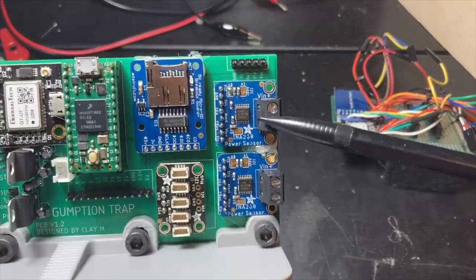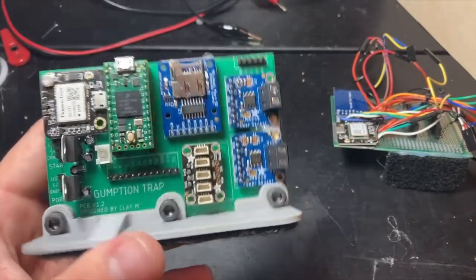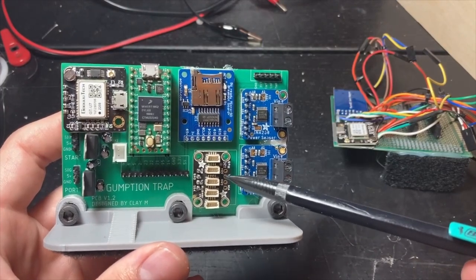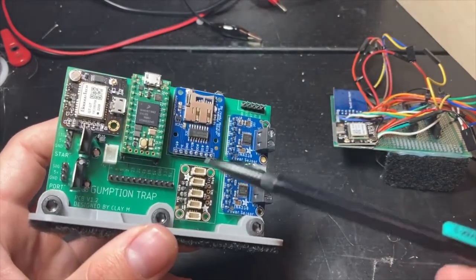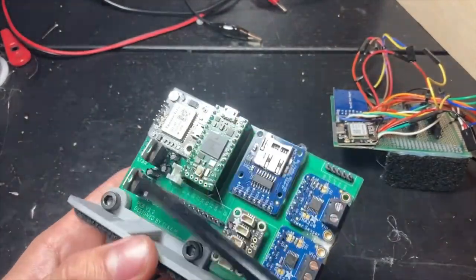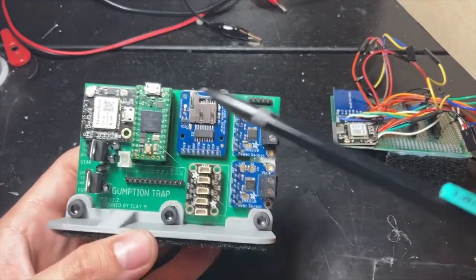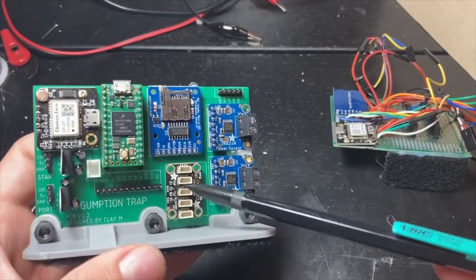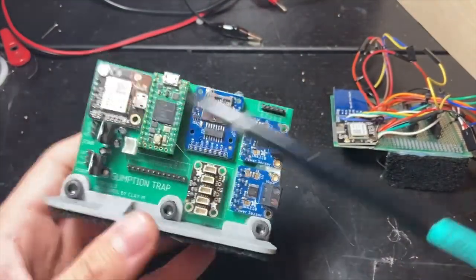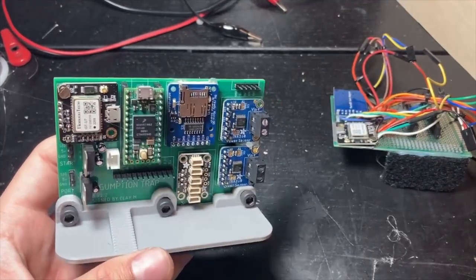I've added these two power sensors, one's for the power output and one's the power in from the solar panel. That'll detect the voltage and the current throughput. There's an I squared C expansion module, so I'll hook up my compass to that and possibly some other future additions. There are also 3V3 voltage regulators and some small capacitors to go with them. Those power the GPS, the power sensors, and the I squared C, as well as potentially some other expansion stuff, and some of the same connectors for the ESCs, the same radio module.